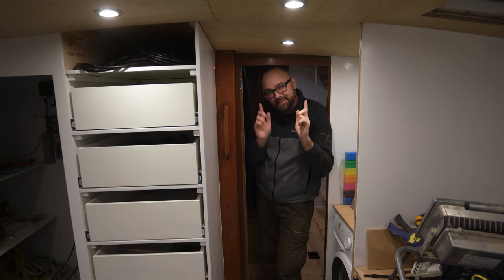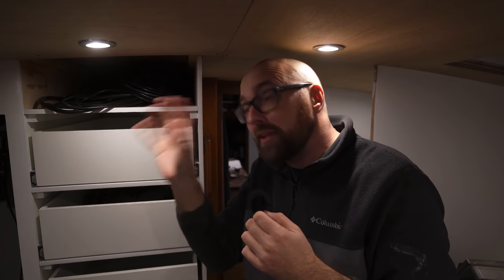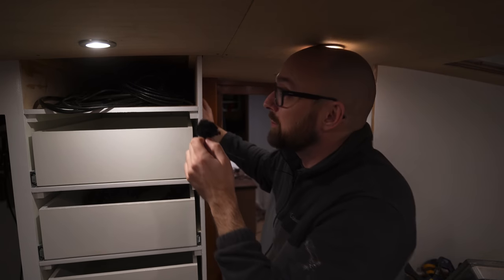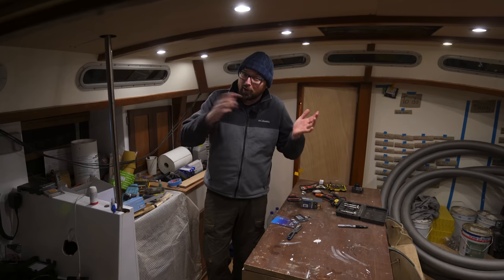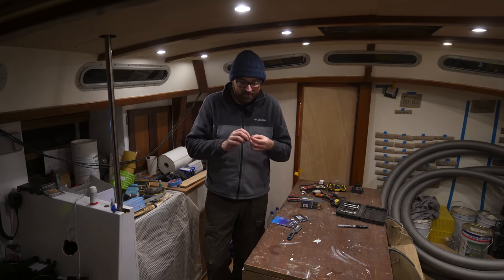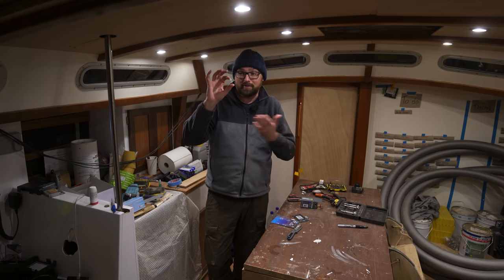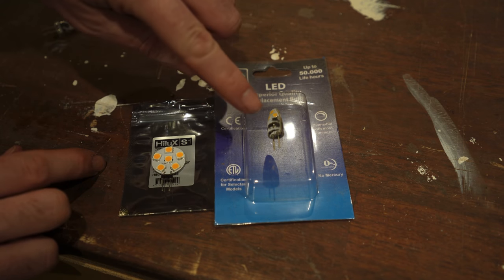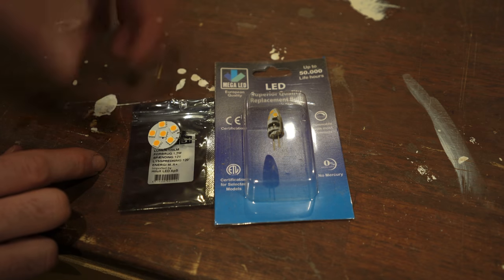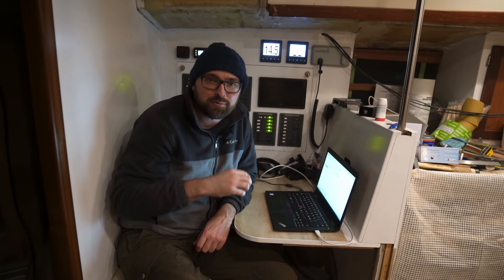There is however one little annoying thing and that's the fact that the LEDs are humming. Just to be perfectly clear the flickering you're gonna see is only on camera — I can't see that flickering. It's now a couple of days later and I would absolutely have sworn that I tested these LEDs before purchasing 20 of them, but I must have messed up somehow because these hum. I've found an alternative — it's not as nice, and it's 12 volts only whereas the humming one is 12 or 24 volts. The humming is definitely a no-go, so I will continue the hunt for the perfect LED because the one I've found now is just a hair too yellow for my liking. I'm sure there's something out there that will be the right color and not hum.